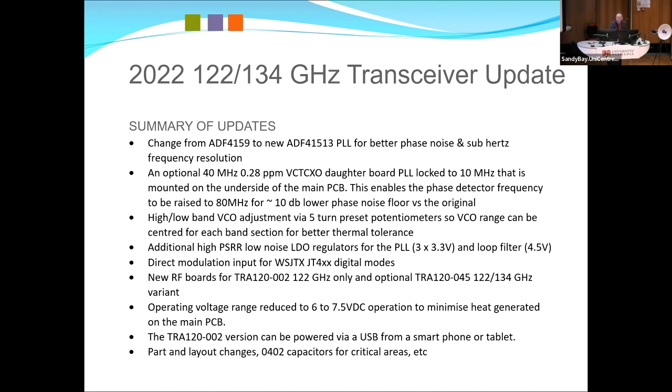New RF boards for the front, so there's actually 4 now, so you can use any of the chips, and for the differences in the chips, they're all pin compatible on the front of the board, and if there's any pinouts or logic changes, that's all done on the small board. The reason it's on a separate board, once again, is to keep the noise pickup to a minimum. It's T-soldered, and right behind the chip, there's a great big lump of copper that keeps the thermal stability better than the original, even the silicon radar test boards.